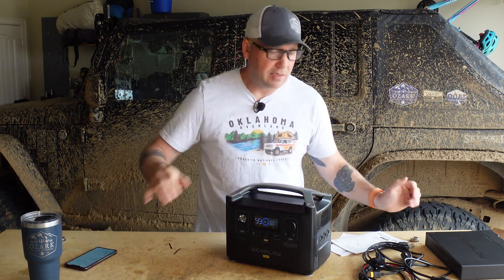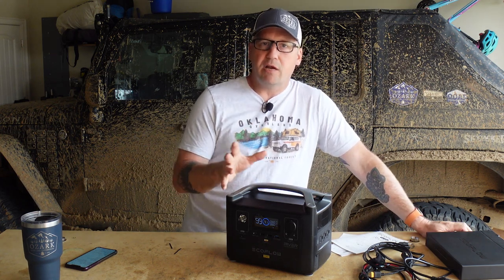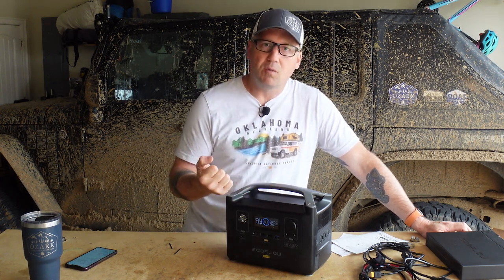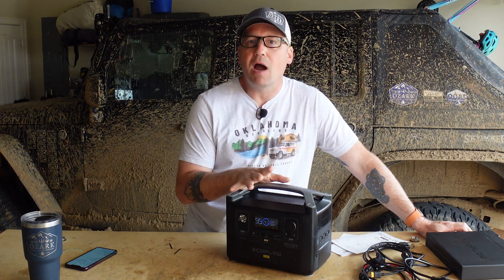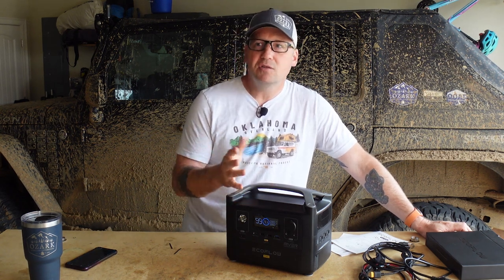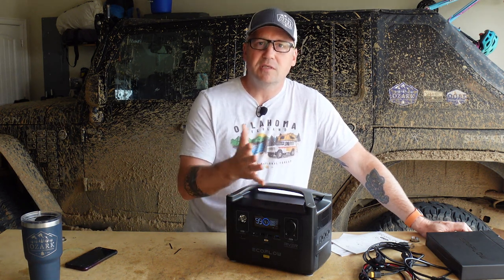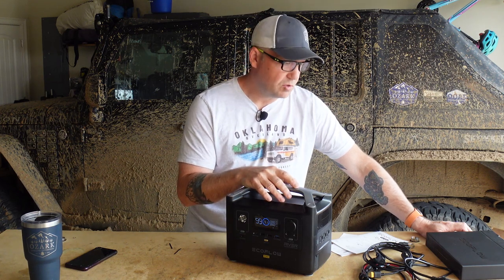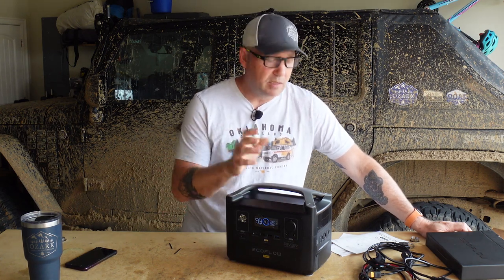So let's talk about that crazy charging time. A typical power station like a Jackery 500, Bluetti AC50S, Goal Zero 500, plug the wall adapter in, and it's going to take, you know, 6-7 hours to charge it from 0 to 100%. They're pulling about 100 watts or so with their power supplies, and, you know, 500 to 600 watt hour battery. That's going to take 6-ish or so, or a little bit longer, hours, depending on how powerful the power bank is.